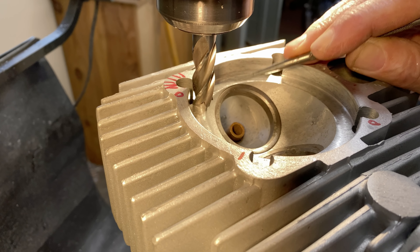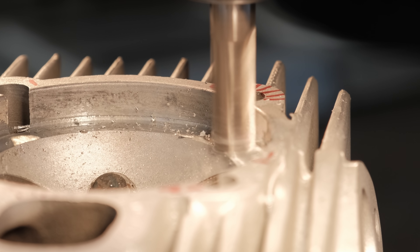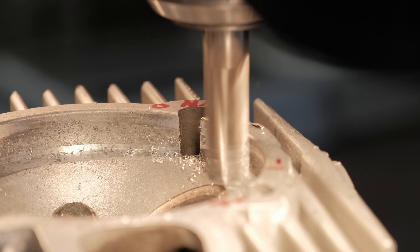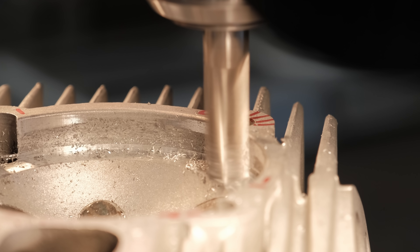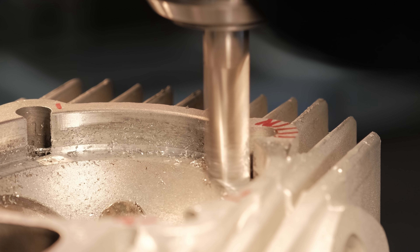This is a half inch rod - I'm going to move this to zero and then lower it down using a piece of paper. That's going to set my Y so I won't have to move it until it hits the wall. Here's my paper - see that? It's just grabbing. I'm zeroing my Y. That's my zero there. I think we're basically ready to start milling.